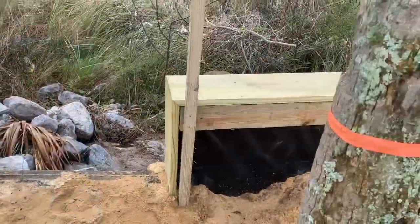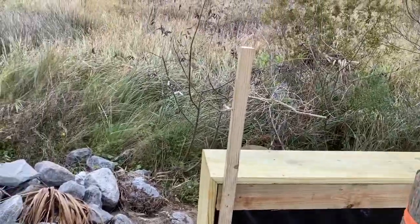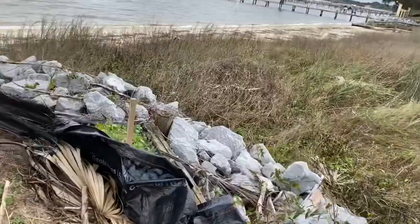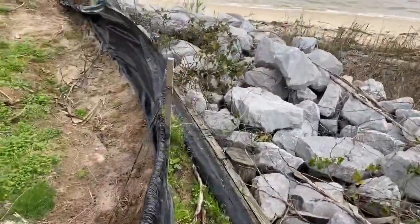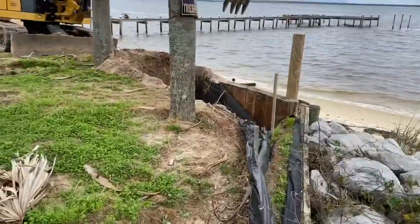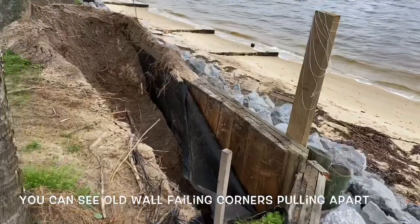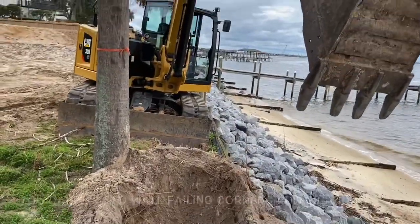We're gonna take the wall from this retainer wall right here that we just installed on the wetland side. We're gonna go up probably about 1.5 feet or so where you see that nail. Right on the inside of this old retaining wall, we're gonna dig this out, put a new wall in its place. Got a lot of palm roots here to deal with. Already started excavating this corner right here. Work it all the way down to the other wall we built on the other side and connect into it.